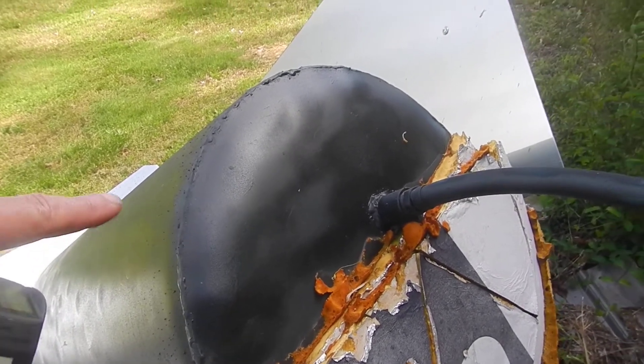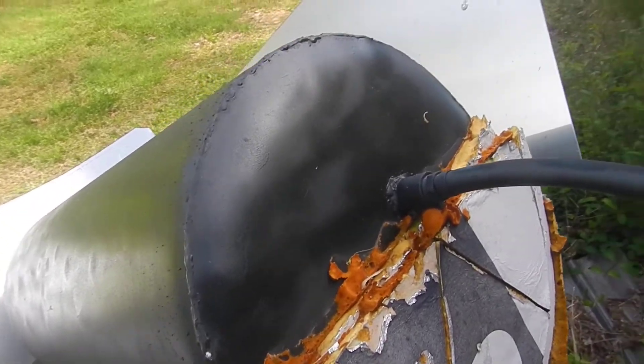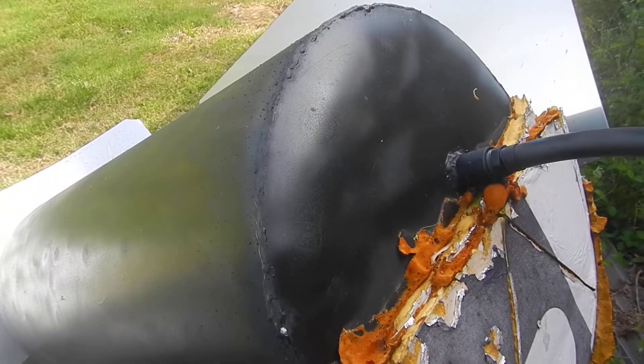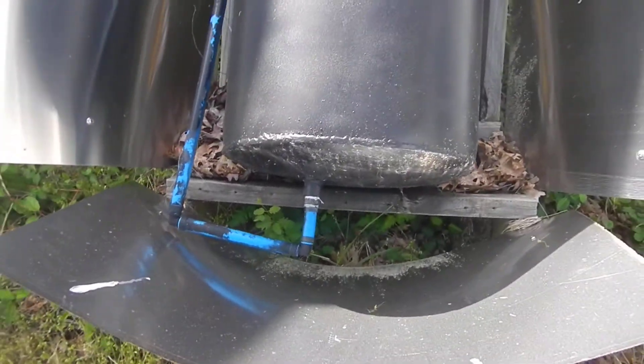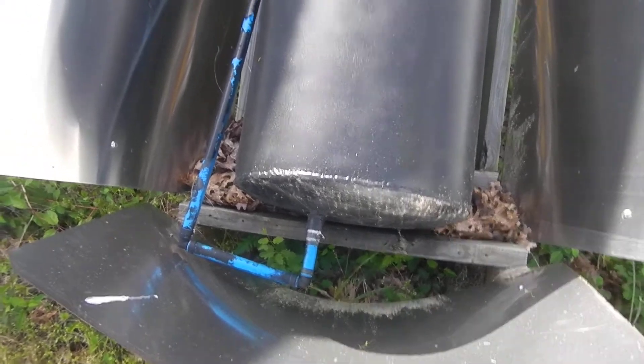Otherwise, if you fill the thing up where there's no air in the tank, it'll split welds pretty fast. It's a stainless steel tank. I've got feed in at the bottom, and I've actually got an internal cover on that bottom that is welded, so the water coming in doesn't shoot straight up — instead it deflects down at the bottom and fills up from there.